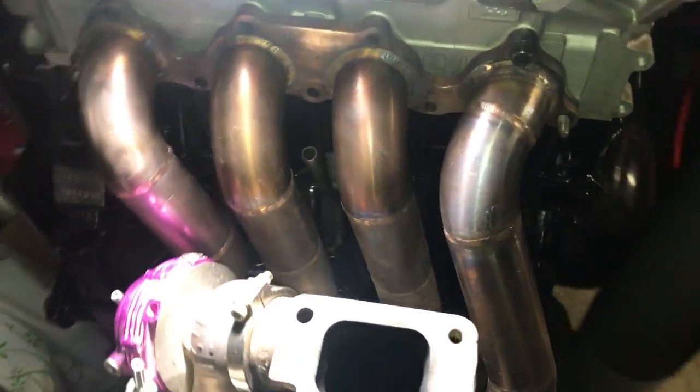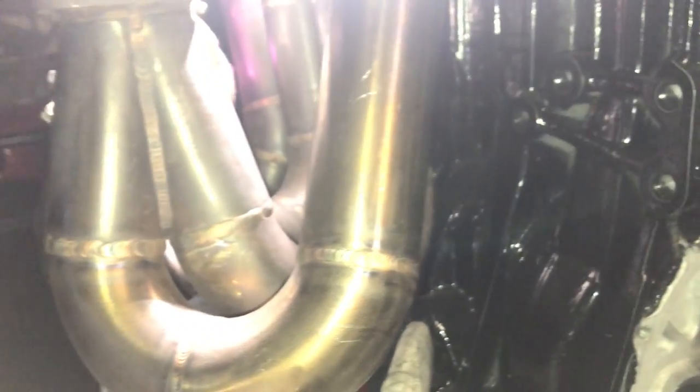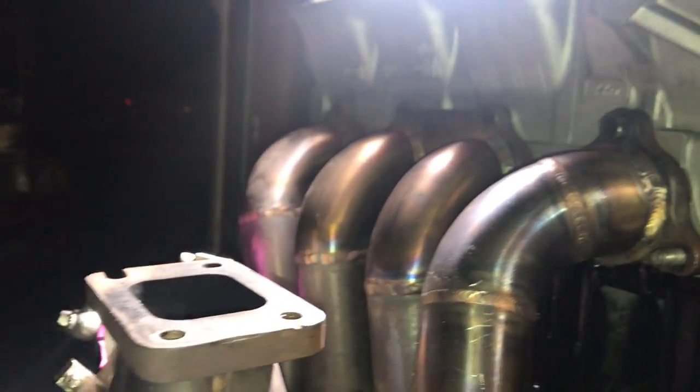So I got the top mount mounted on the motor on the stand where the ram horn was sitting on. Because what I'm going to do now is probably going to make some small little brackets here and there. Possibly this one right here at the bottom. I don't know if you can see it. Possibly using this hole right here and making a support or something, so that way it's supported down here, and the flange is not stressed off by the runners and the turbo.